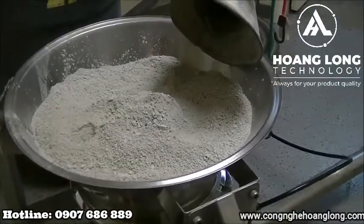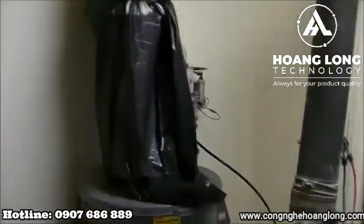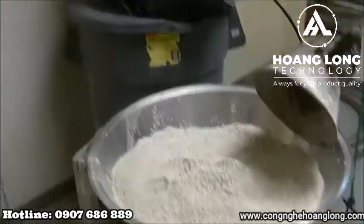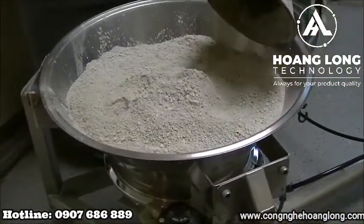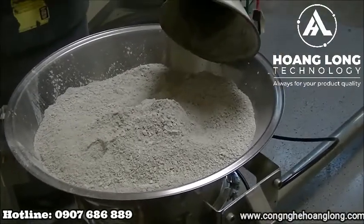Then we'll take the product, which will catch here in the bag off the chute from the PIAB on the mezzanine, weigh the bag, and be able to calculate an overall transfer rate for the amount of product that is currently in the feed station, giving us an overall average hourly rate of hopefully at least 3,600 pounds an hour.